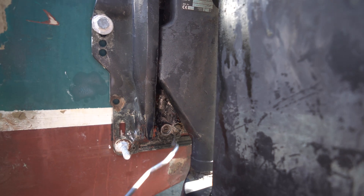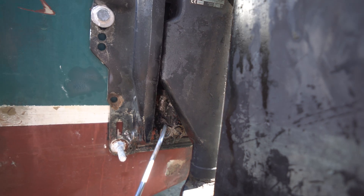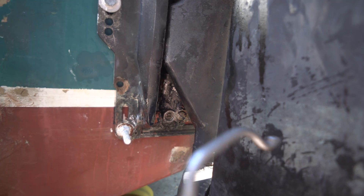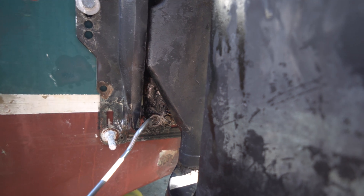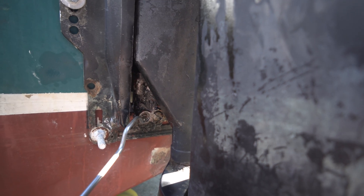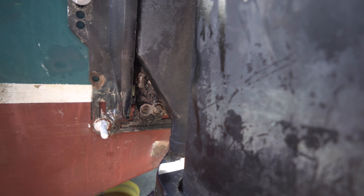So on my primary motor, right here, this is the screw for the manual release. When you want the motor to stay in whatever position you have it — up or down — you screw this in and it will not move. To move the motor, you simply unscrew this about four or five turns and the motor will now be able to lift or lower.